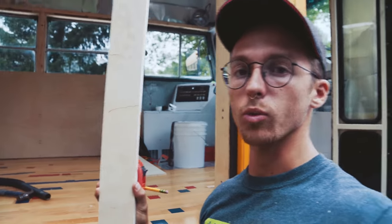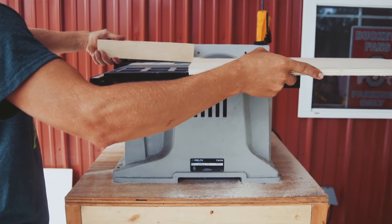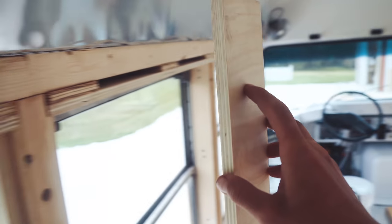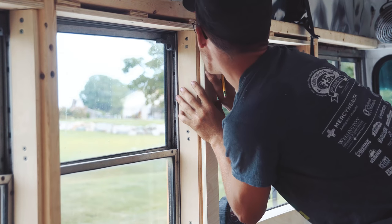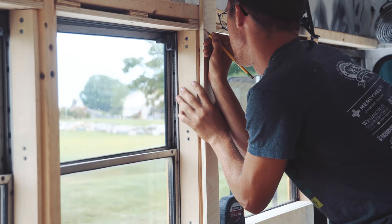The next step, after I cut all my window pieces — we did what we call a rough cut. I always recommend this when you're cutting pieces. Rough cut means I know one dimension: in this case, every piece was always going to be three inches wide. But if I cut every piece to the same height they would probably be mostly wrong, since different parts of the bus have different heights. So I cut extra, and now I'll go measure closely, then chop off the top with the chop saw. Each piece will be custom so I can't mix them up.